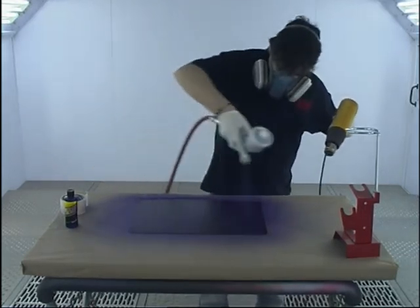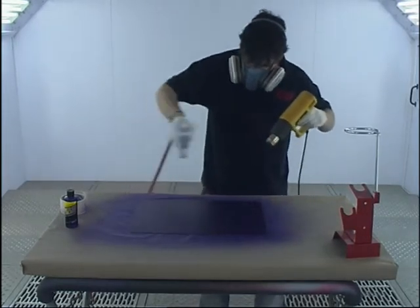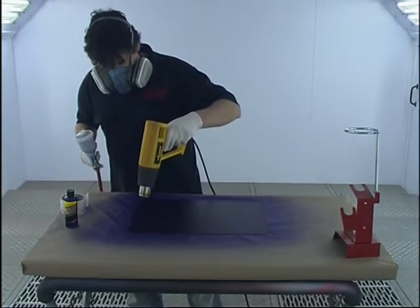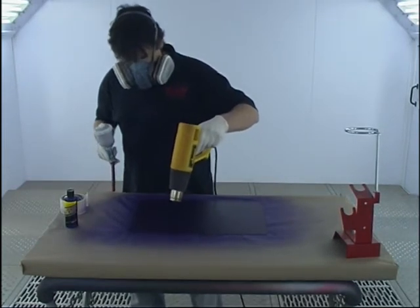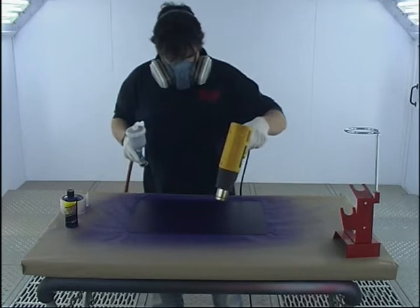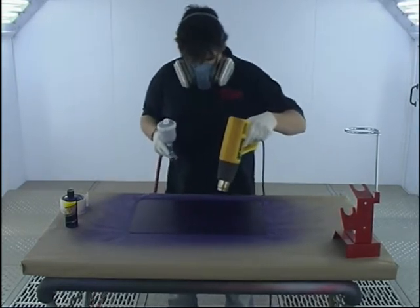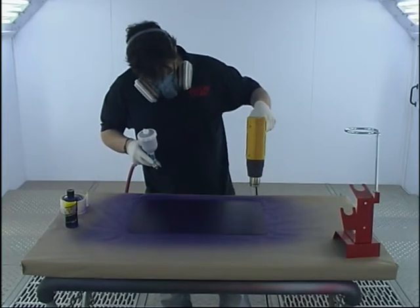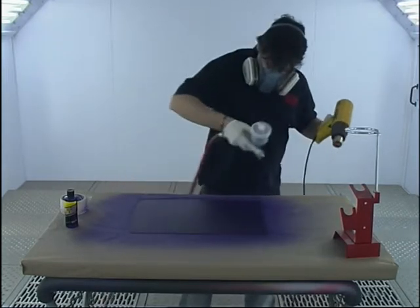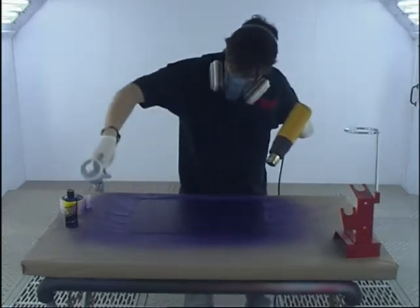I'm coming in with my second coat, and amazingly the paint is only 30 to 40 seconds old and I'm still getting my second coat in. As soon as that paint dries I can come in with another coat. With solvent-based paint I have to give it a flash-off time — the flash-off time is the time it takes a paint to chemically dry before it can be recoated. But if my paint does not contain chemicals, I do not have to abide by these rules. So after just one minute, I've got two coats on — you can see it's completely flashed off, the binder has evaporated, and I'm ready to come in with my third coat. If this were solvent-based paint, I'd have to leave it for at least four or five minutes before I could reapply.